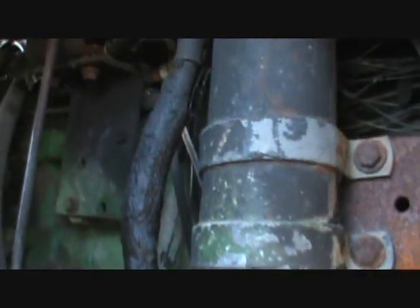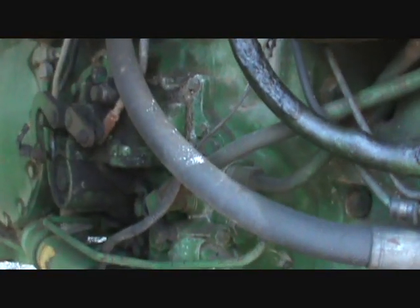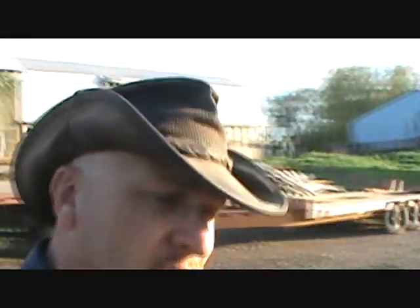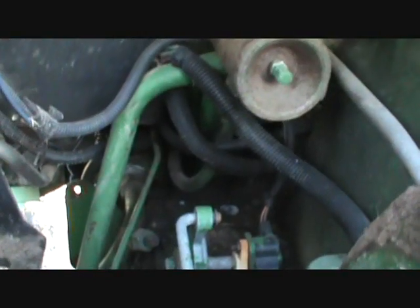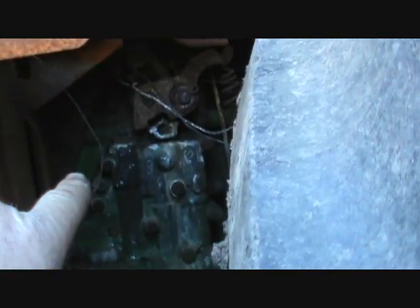My main concern, and the concern of the guys I talked to about this tractor, were obviously these valve assemblies, because they're aluminum. They asked if they melted. I said I don't know. They said, well, if they melted, then it's going to be a lot harder to fix. The other thing they were concerned with in rebuilding the tractor was right up on top — not all my wires burned either, which is a good thing. Right up on top where the transmission plate cover is, that's where the power shift transmission is. They were concerned as to how hot that got, because there are O-rings in those power shift packs that can cause major problems. I can see now that it never got that hot. This valve body here did get hot, but it didn't melt.